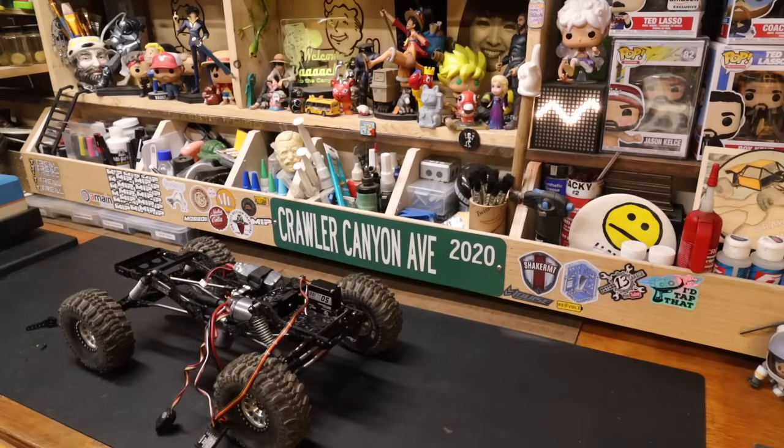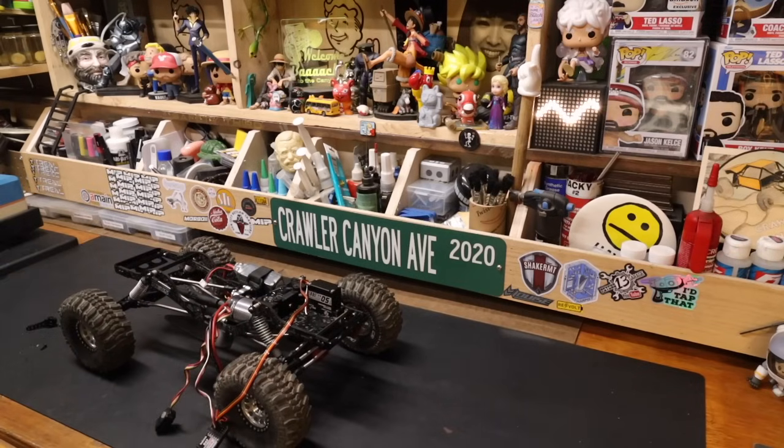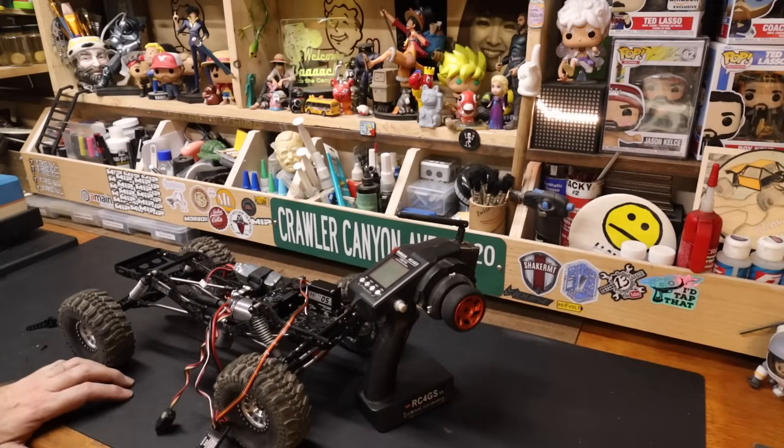In terms of placing all the electronics, I will need something to run the winch. And I usually gut like an SC400 or an SC480X, and I use that as a winch controller. This guy is going to be on an RC4. We'll do channel mixing. I believe, if memory serves, I can do cruise control mix and winch mix on an RC4. I'm pretty sure I did it on an RC4. I might have done it on an RC6. But if I can mix both, that will be great, because then I can use a VR for that.